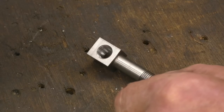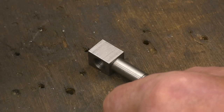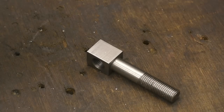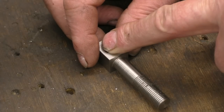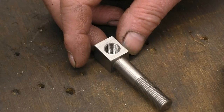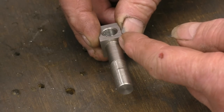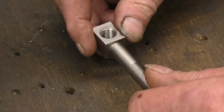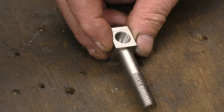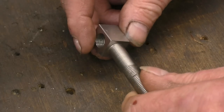This is a seat bolt made off a kit car that a friend of mine is building, and what I've got to do is make some longer ones. Looking at the design, it's basically a 7/16 UNF thread in there — that's the standard seat belt thread — but what worries me is that shoulder there is a sharp 90-degree shoulder. I'd like to see a fillet on there so it's got a bit more strength. When you only need a seat belt once, it's only going to do its job once, and you don't want anything to fail.